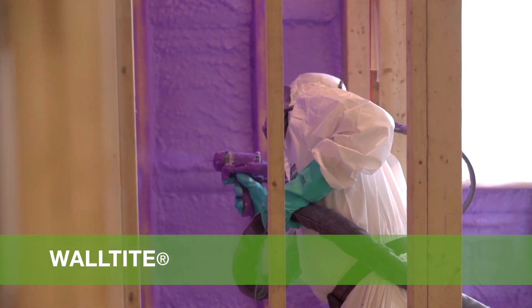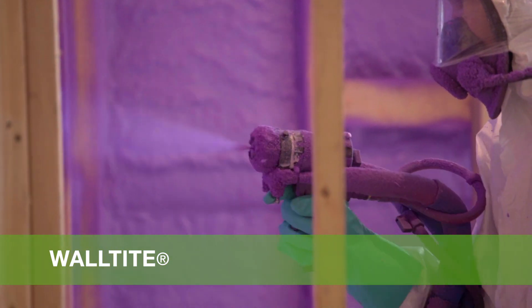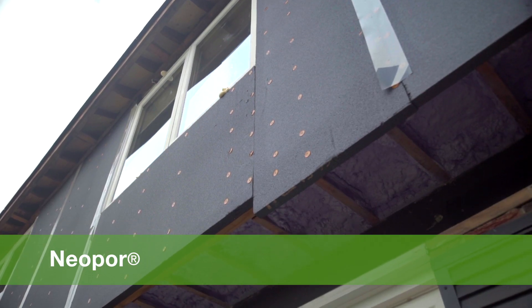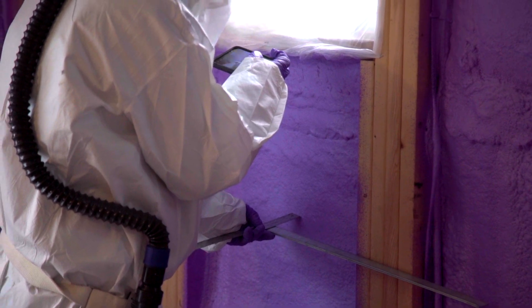In this particular home I have 4 inches of spray foam on the interior and 2 inches of rigid neopore on the exterior, which gives the envelope an effective R-value of around R-35 — almost double the current building code requirements.